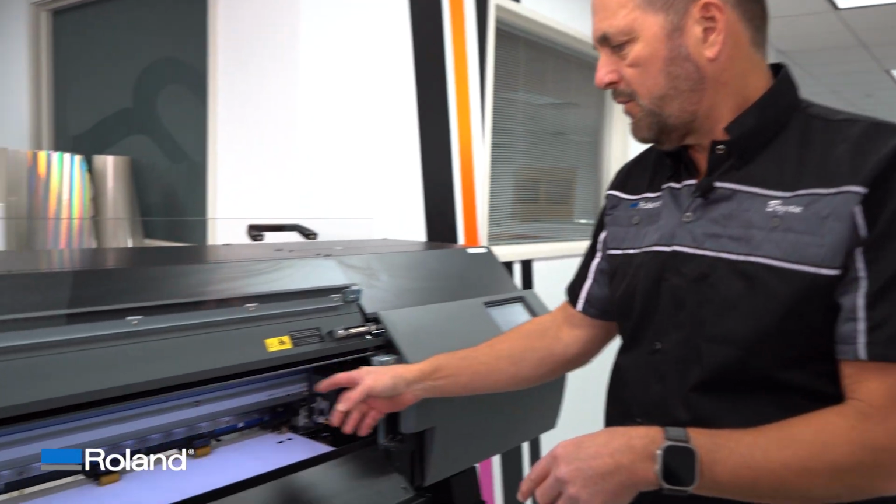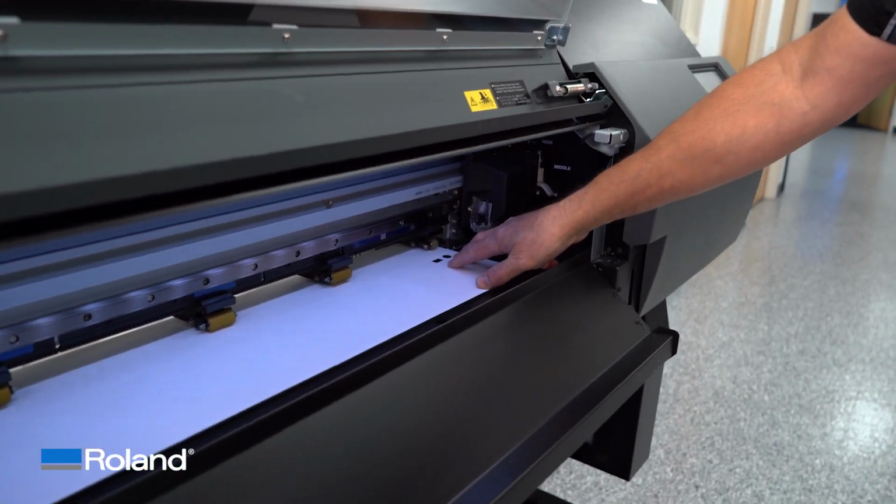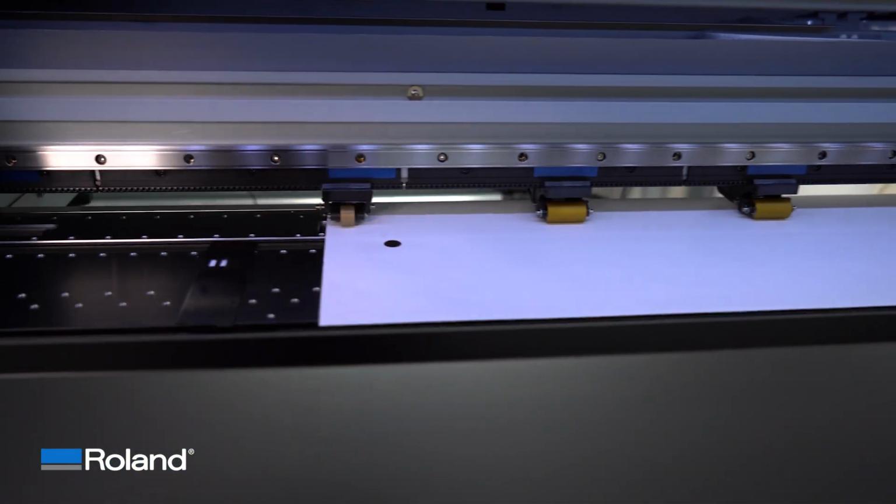So it's come off the back, you're not pulling from a roll anymore. So in that case, let's assume that it's a print and cut job. That's a very common aspect. So if you come in tight, I'm going to show you, we've got these pre-printed dots. This is the alignment points. So here's origin, there's another one at the far edge.